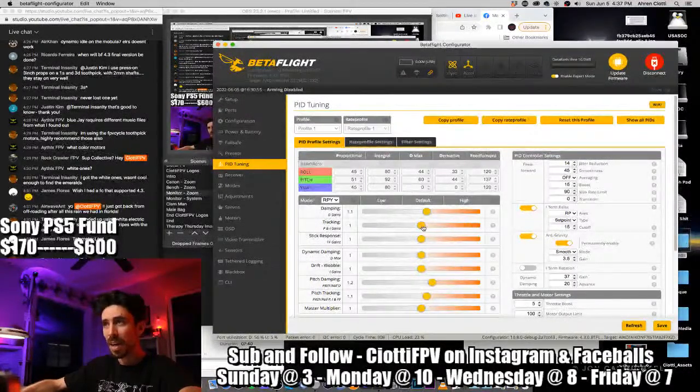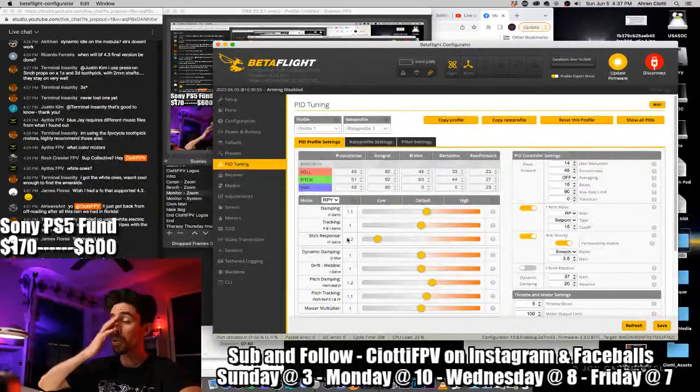So let's keep going. Tracking P and I gains, the defaults are now really good, so I'm going to leave that alone. Feed forward, I run that extremely low. I do not like how jittery feed forward makes my footage look, so I run this all the way down to 0.2. If you're not trying to make cinematic footage, you can run this higher and have a much more responsive rig. But I want my footage to look buttery smooth, so I run this nice and low.